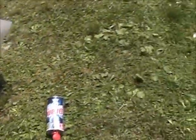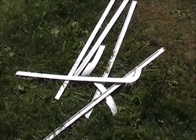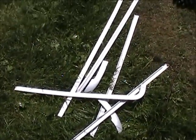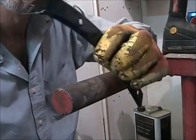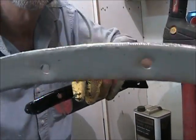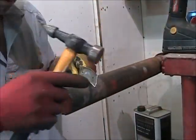Sure saved a lot of work but there's still a lot of work left because I'm going to sand all this stuff - probably start with 600, then 800, then 1000, then 2000 - then polish it with the metal polish. So far that's what I got, and it's getting closer to looking like this one. I just gotta beat that roll and that edge a little neater.